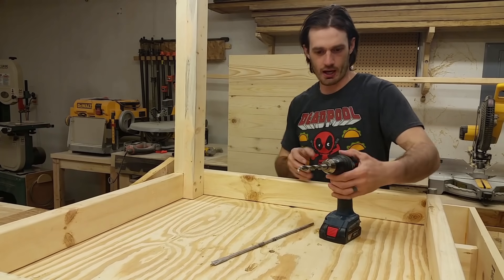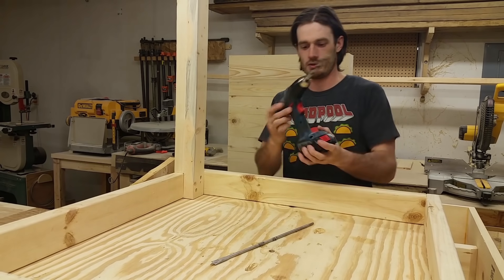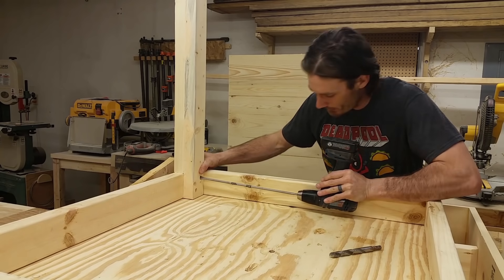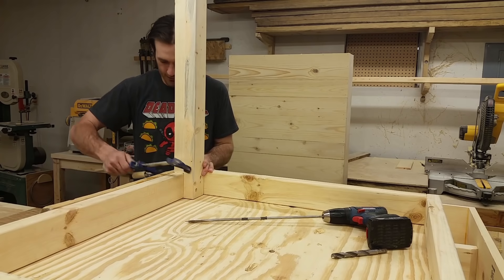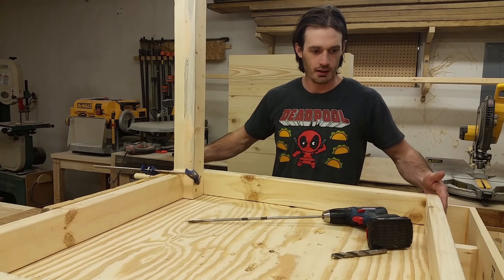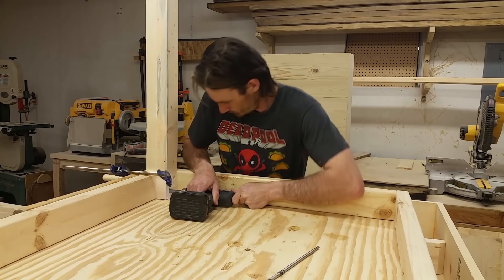I have a few options. I can come in and drill out the hole with this size bit, but because of the amount of space I end up at an angle. I don't want to pull the hole at an angle if I can help it. So I have this longer bit that if I come way out here and use it instead, I'll be able to keep it a lot straighter in both directions. The other part is I want to put a backer on the back of this and clamp everything together so that nothing moves. As soon as I pull through that other side it's going to rip out the back and leave an ugly hole, and since this is going to be visible from the front I'd rather avoid that.